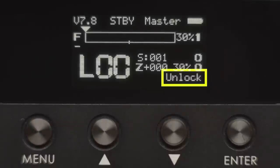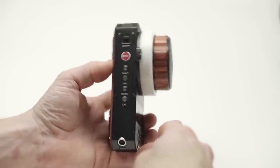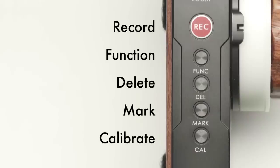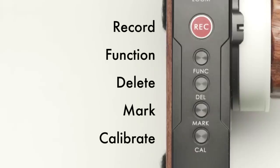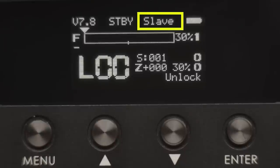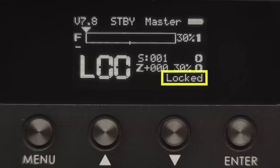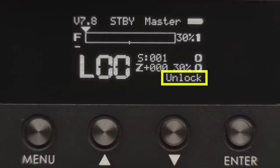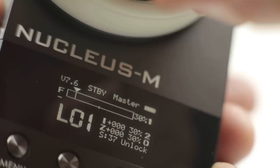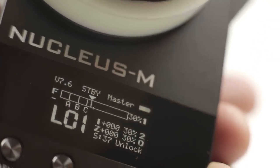There's also an indicator of the lock mode, which prevents accidentally bumping it. Turning the controller on its side, we see Function, Delete, Mark, and Cal. Tap Function twice to switch between master and slave mode. Press and hold to engage the lock function, and press and hold again to unlock it. Tap Mark twice to add a mark — the hand unit will vibrate when the mark is hit. You can add up to 10 marks in total.